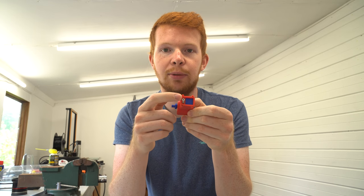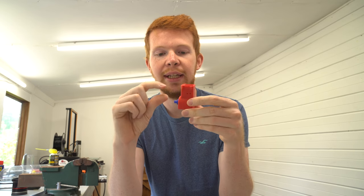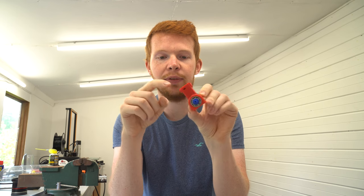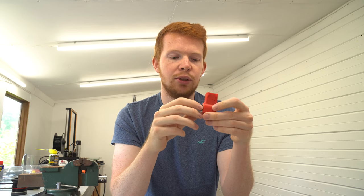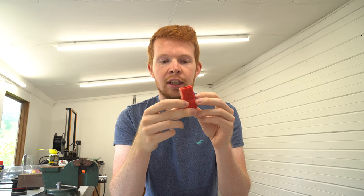Last week, I explored the idea of having an exhaust port at the top of the compressed air engine cylinder to allow any trapped air to escape via this valve. However, the dual cam system and dual spring system just proved to be too much friction for the engine to run past. So instead of increasing the efficiency, the engine didn't run at all.